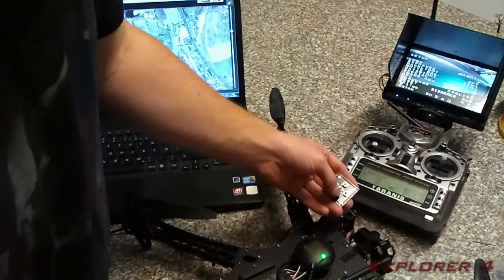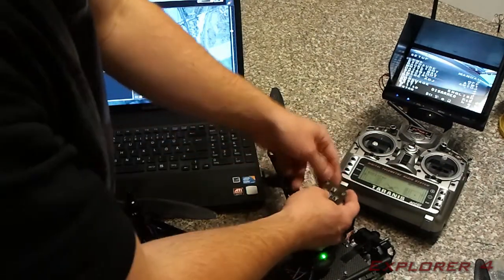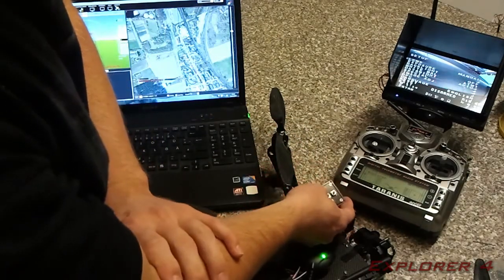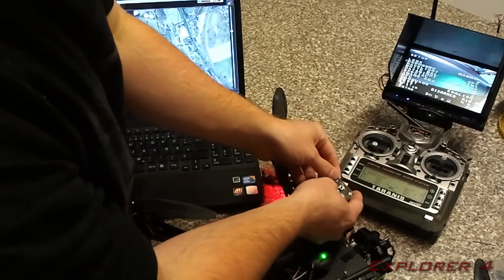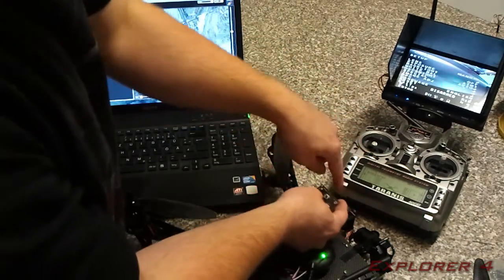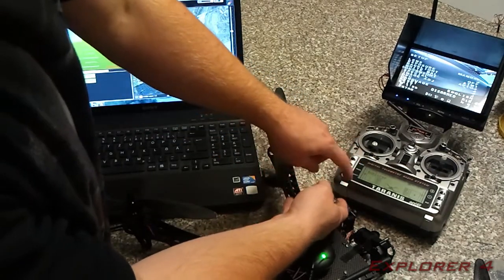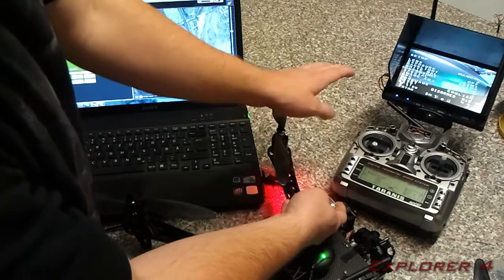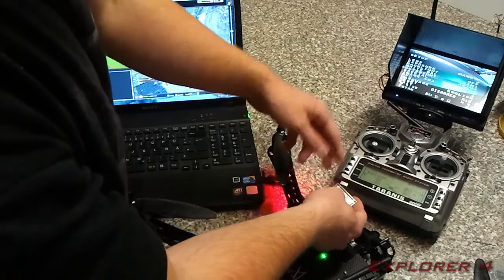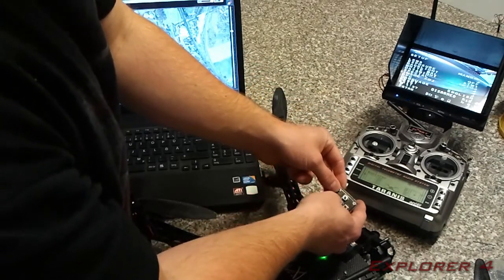You're going to press the middle button, and then you're obviously going to have both screens on your screen now. You're going to have the menu from the camera and the OSD screen as well, so it's a bit confusing. I would advise setting your camera up before setting your OSD. So basically go into your software and make your OSD display nothing, and then set up your camera how you want it, and then go in and set up your OSD again how you want it.